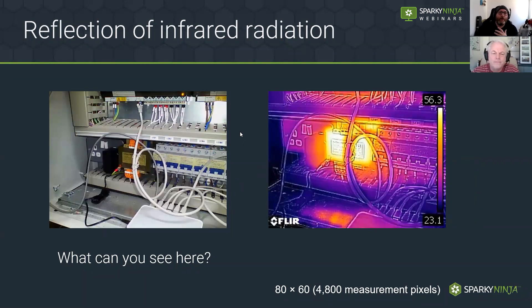In this image I've got out of the way — you can tell from the angle. We've got a transformer which is quite warm, as expected. We can check the span and level. There is some temperature here that is just a reflection from a shiny surface. We must always make sure we identify reflected temperature.